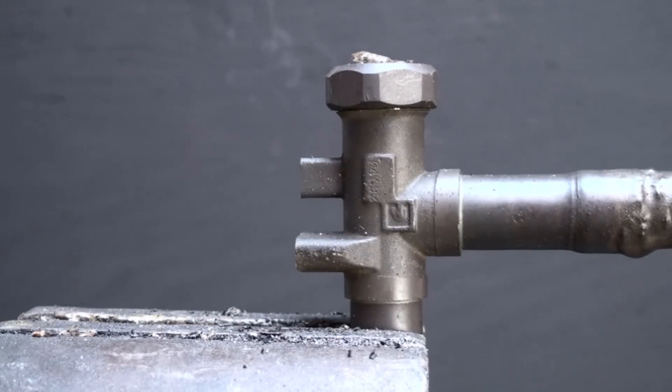There's an O-ring in them and you can replace it. It's not something I absolutely recommend — I would rather replace the valve, but then I'm a service tech, so I tend to want jobs to be done and over with. But if you want to replace the O-ring in one of these, it very possibly may work, and I'll show you how to do it.